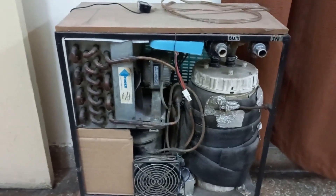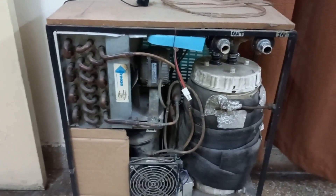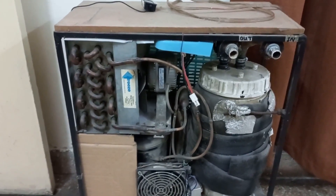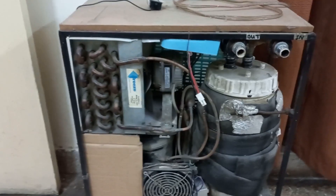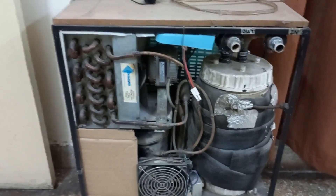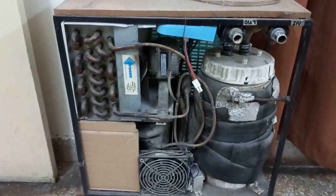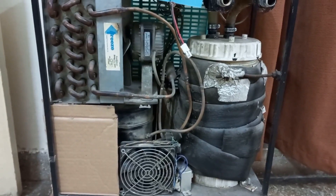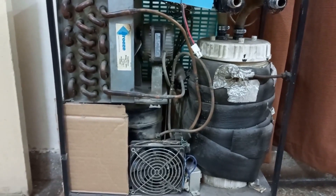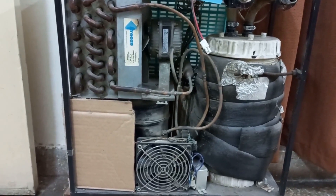Here is the chiller which I made at home. I made 5 aquarium chiller versions. Version 1 and 2 were small — okay for maybe 30 gallon maximum, but not for this tank size. So I made versions 3, 4, and 5 with a big compressor, updating and modifying little by little. This last version 5 has been working best for the last 2 years, and the final cost is 200 to 300 dollars. No doubt the original aquarium chiller gives very good results, but this works well given its cost is much less.